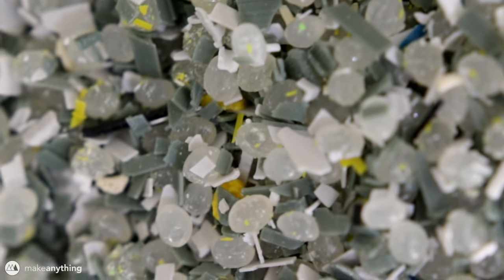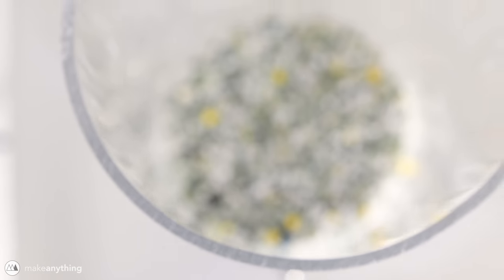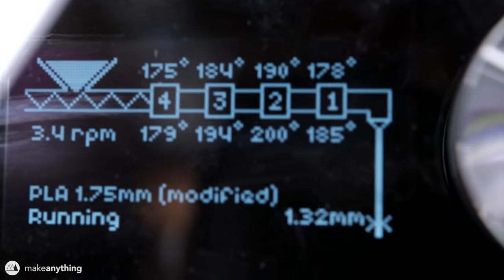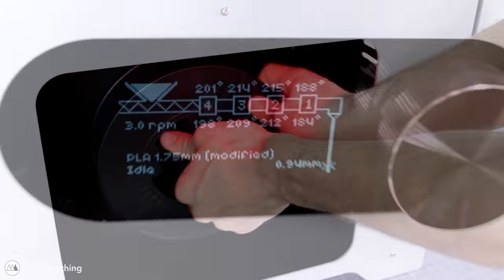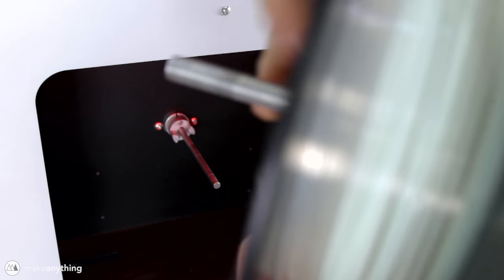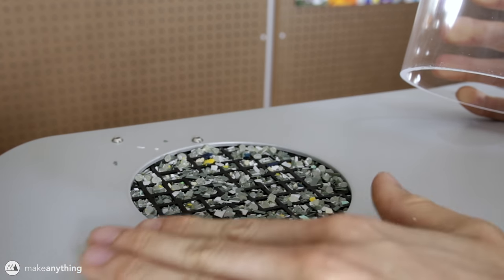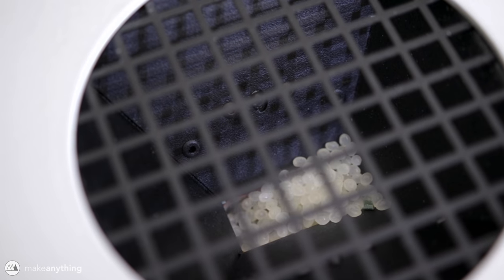Here's a close-up of what my mixture looks like. Some of the largest shreds of recycled plastic were maybe a centimeter wide, which is a bit larger than they should be. Sure enough, as soon as this started extruding, the consistency definitely took a turn for the worst. It's extruding at 1.3 millimeters, far less than the 1.75 we're going for. As I continued tweaking settings while extruding, things only got worse until it became far too thin. I suspect I hadn't shredded my failed prints enough and may have clogged the hopper, so I took a shop vacuum and sucked out as much of the extra plastic as I could.